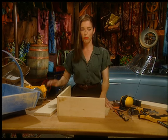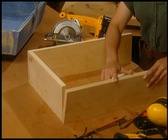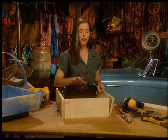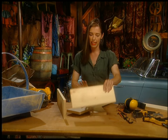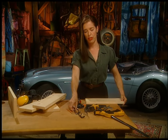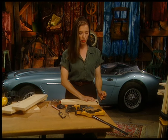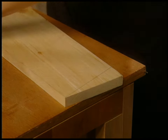So you set up your little boards that you cut out and you say, okay, I'm going to make a basket and I want it to lean out a little bit, like about that much. So you need to know what angle that is and cut it on the board. First thing you do is cut that angle on this board and just see how it looks. So you take your little board over and you're going to need a protractor, hopefully you still have one as a relic of geometry class. This is a really neat one I got. It's set at about 15 degrees, which is that approximate angle. So I just mark it like that and then I'm going to clamp it down.